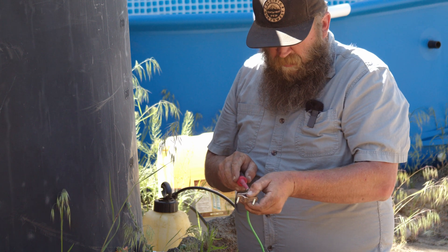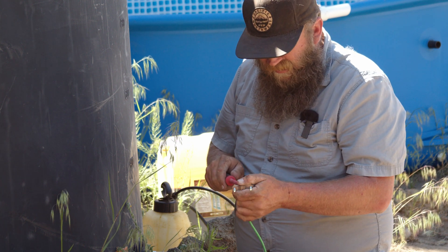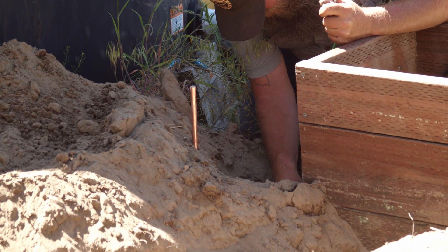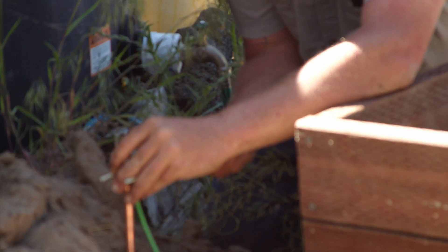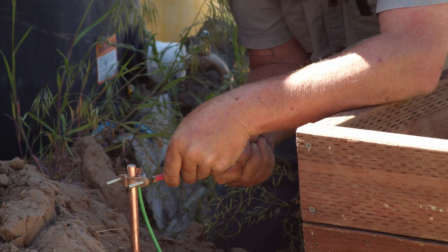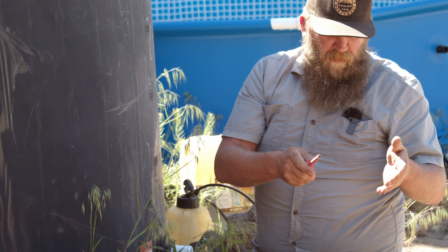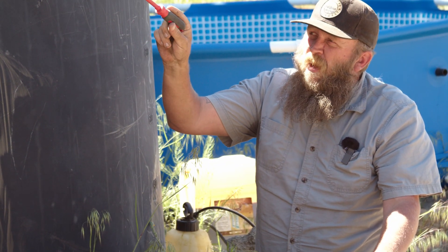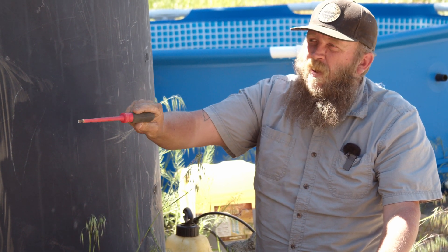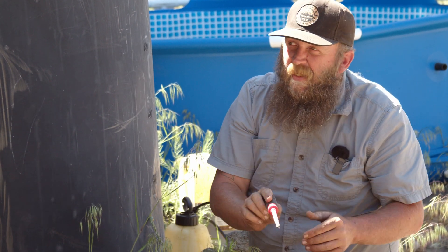I like to get everything prepped and made up before I have to bend down. Put this down through this hole here. There you go — you've got a ground into the box, and that'll connect to the ground inside the charge controller, which has a little bus with three little ports. The ground we run from the solar array will also ground to the pipe that goes into the ground, and then we'll go into the box and through the conduit with the plus and minus from the solar array — all terminating at the charge controller.